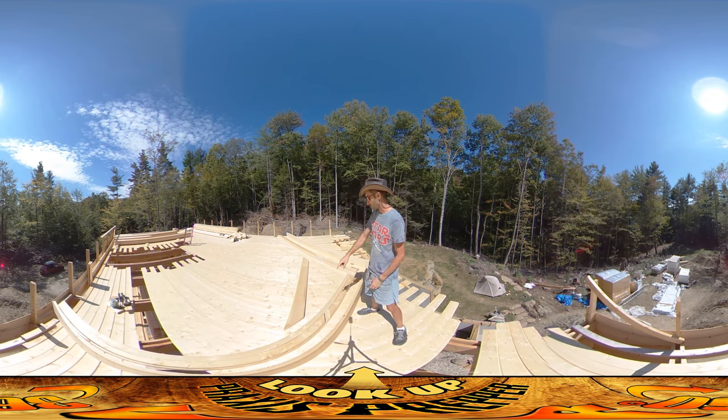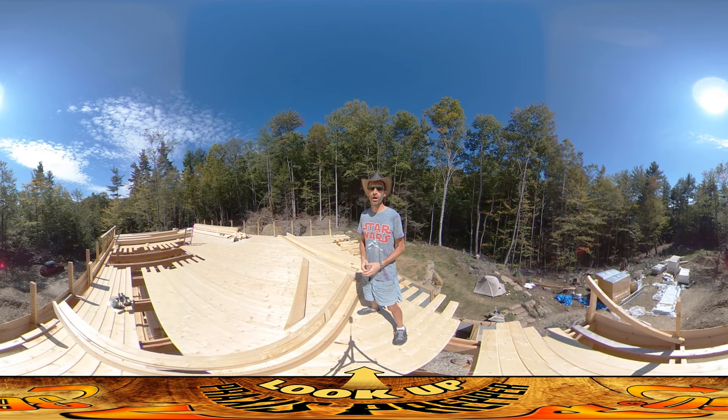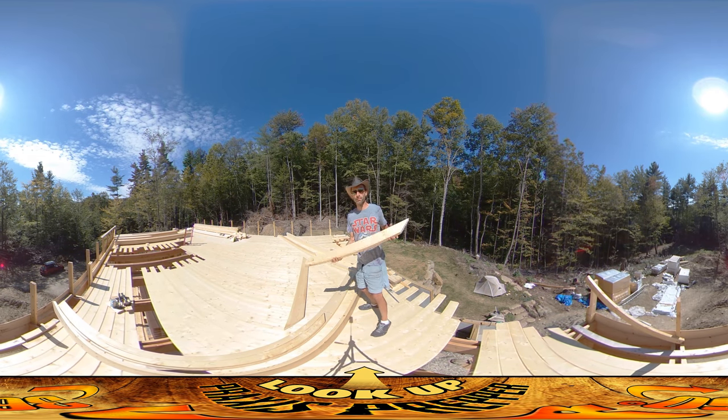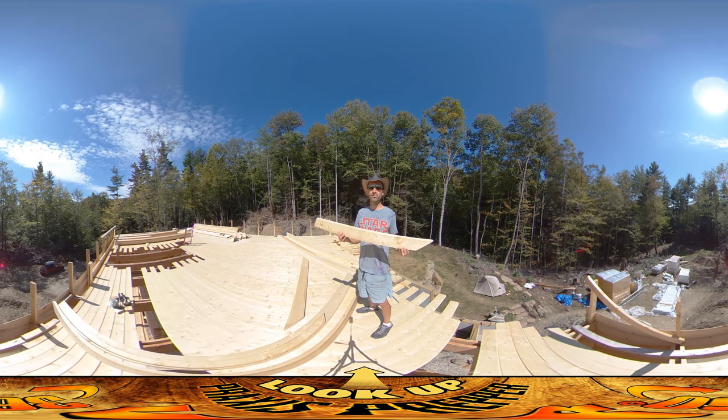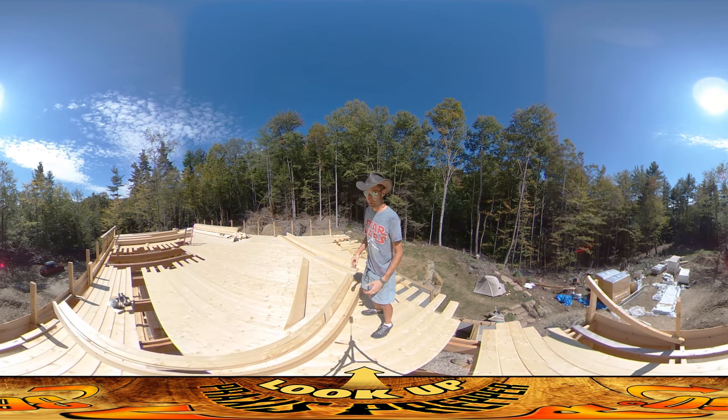You can see the pieces down here — there's the collar tie and everything's laid out. I took a lot of time to get everything really perfect. I laid it out on the deck exactly the shape that it needed to be, and got all the pieces cut really well. You always want to do a good job, but I want to do an extra good job on these because these are the template pieces. What I'm doing today is taking each one of these little pieces — here's one — and making 10 copies of each, because I need 11 trusses. This is one, and I need to do 10 more.